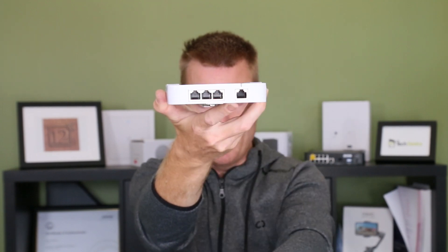This is PoE powered — PoE++ — so 802.3BT. You need to make sure you've got a PoE++ switch or you can use a high-powered PoE injector. Your power in is on this side, and then you've got three PoE ports across the top. If you've just got one reader and you're using a mechanical push button on the inside, that leaves you with two other PoE ports, which you could use to connect two cameras. So this can work slightly like a hub — you get PoE closer to your door. People have done various scripts with cameras connected and sending unlocks.